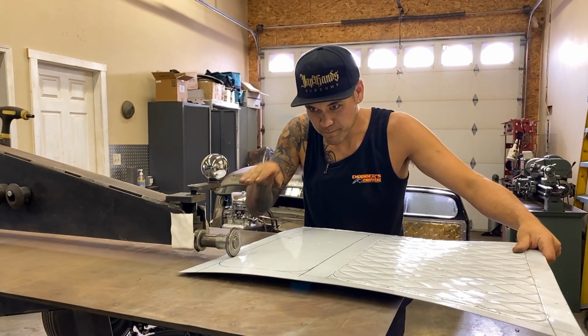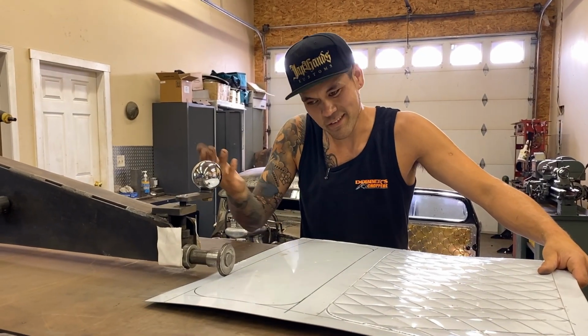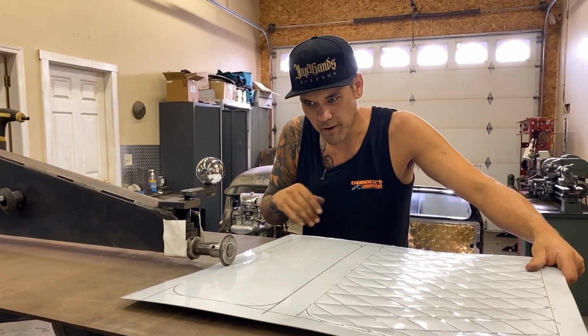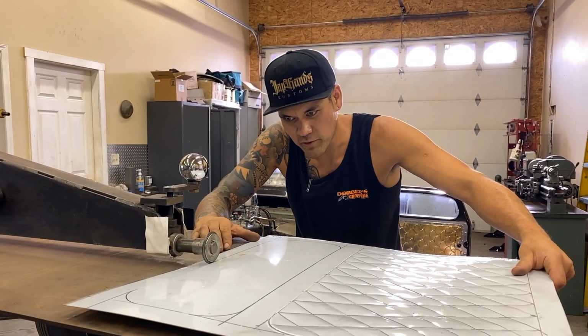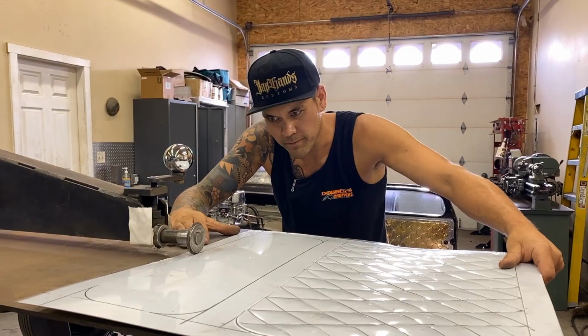Sometimes if I think of it, I'll start rolling it through before I finish my crank. The reason I do that is I find that sometimes you get a little bit of a kink right at the start if you go right down in one spot. Because I run through it again, you can start it gradually. It almost hides the start-stop of the bead roller.